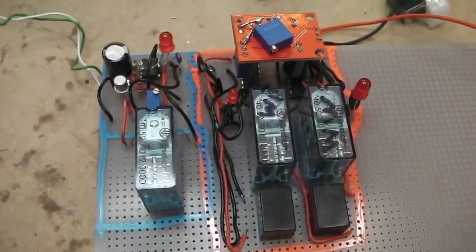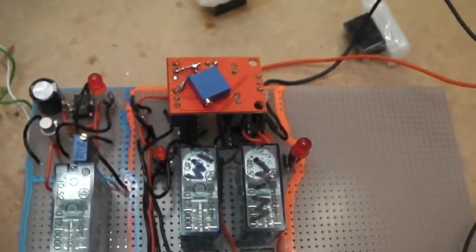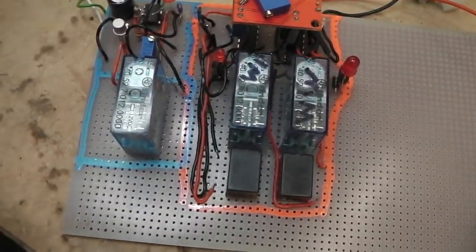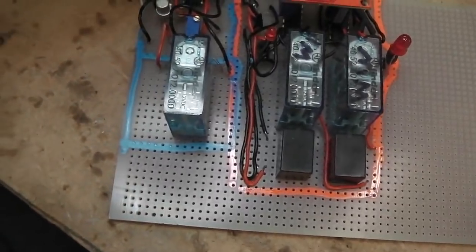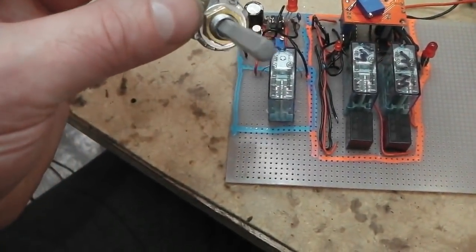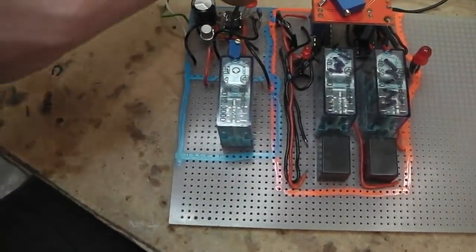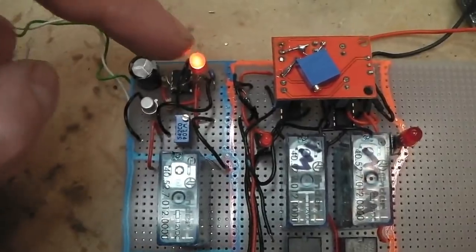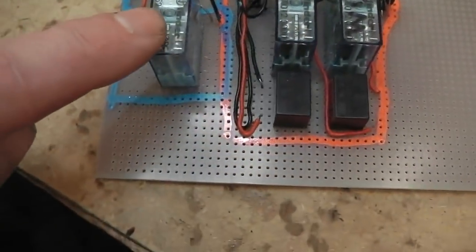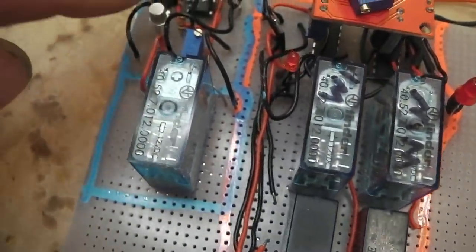It's actually up and running. Power up. At the moment the intermittent's on, but that would have a switch on the stalk. I'm just running it now for testing. This goes near your steering column. You turn that dial, and you'll adjust the speed or interval of the intermittent wipers, and that simply parallels across the foot switch contact. So it's dead straightforward, that.